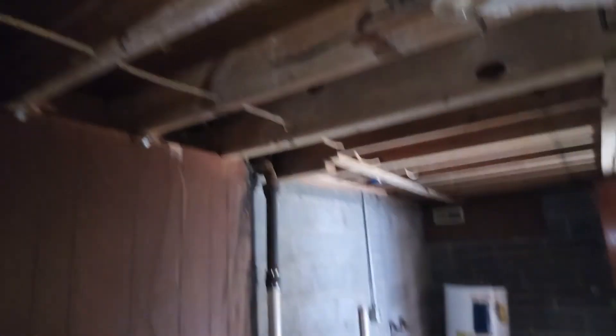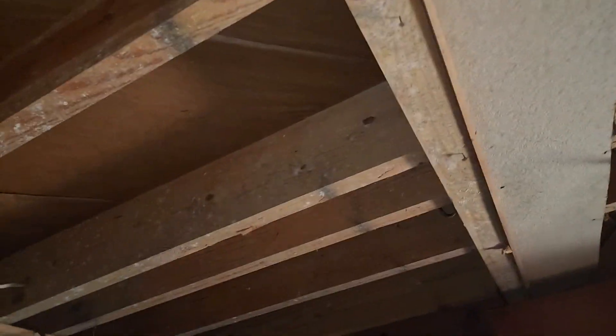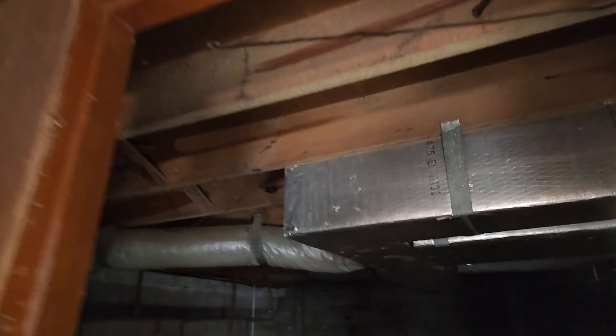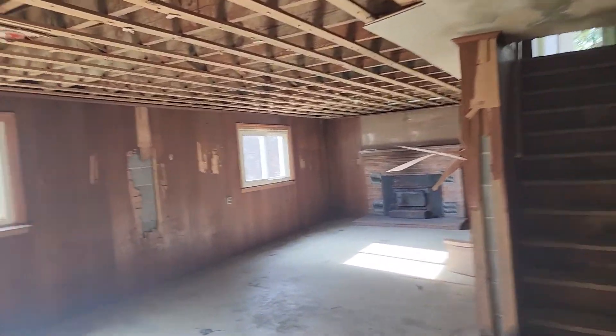In this one, we have to redo the dryer and the water heater — they're both right there. We have to redo the HVAC, which is on the other corner end of the house. But if you look, I have access to almost every single room in the home, and it doesn't look like there'll be any problem tearing more of the ceiling down. Same thing in the bathroom — I can get to every single room up above me, and I have a full walkthrough basement, so I can get to every room in this house pretty easily. This one is going to be on the less expensive side. If this were a completely finished basement, we'd have to wire the entire thing from the attic, and that would change the logistics.